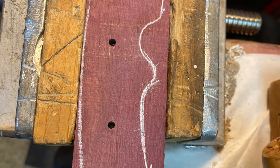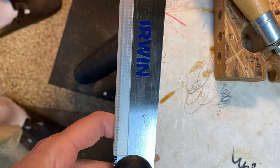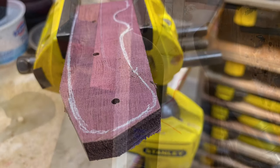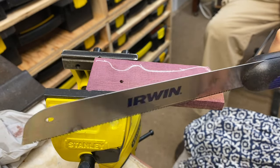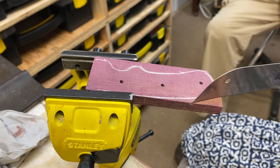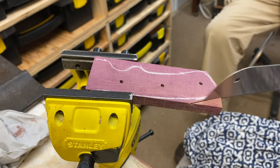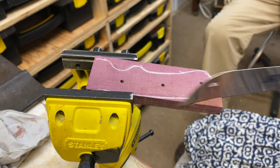After successfully drilling the holes in both scales, the next step was to remove the clamps and the tang and start sawing out the rough shape. I used a Japanese pull saw, which I highly recommend, and then for the curved edges I switched to a coping saw. You could do this on the band saw, but I enjoy working by hand and I'm only roughing it out to a point where I can sand. A note if you're not familiar with this kind of saw: it works on the pull, not on the push. My dad always drilled into me — you let the saw do the work with its own weight. You don't push; you just facilitate the saw moving under its own weight. That way you don't get any snags and you cut as crisply and quickly as possible.